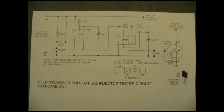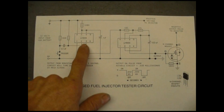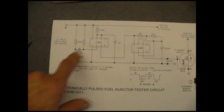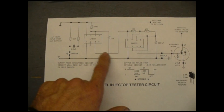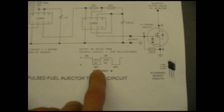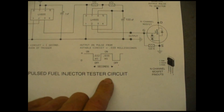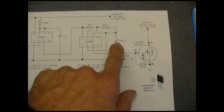The circuit I'm making today looks like this — there's a version available on my website too. Basically, here we have the monostable circuit, which gets triggered by a little push button and outputs a pulse one second long. This output pulse then gets fed into the astable circuit, which will output a pulse that is 39 microseconds on and 32 microseconds off, determined by two resistors and a capacitor.